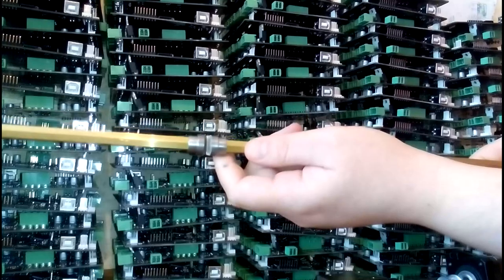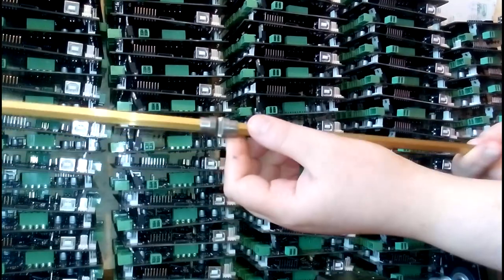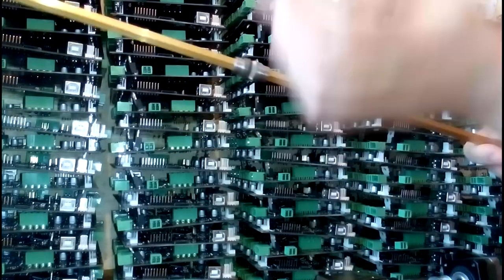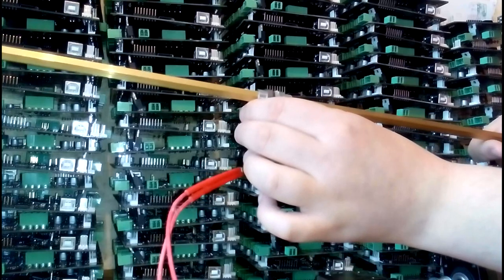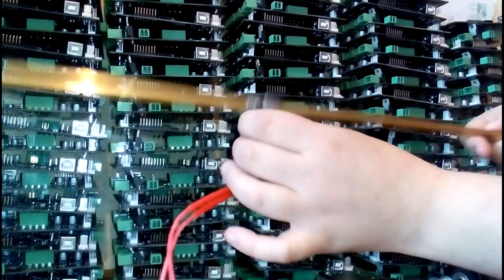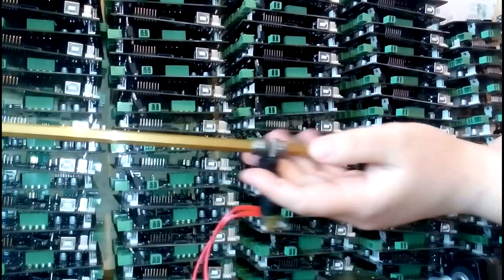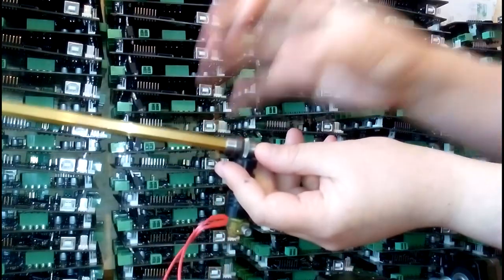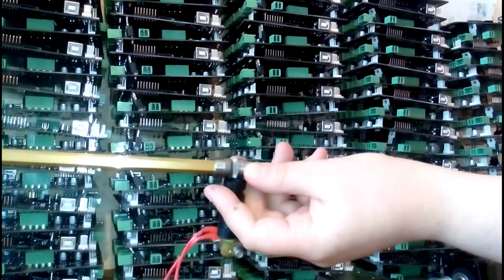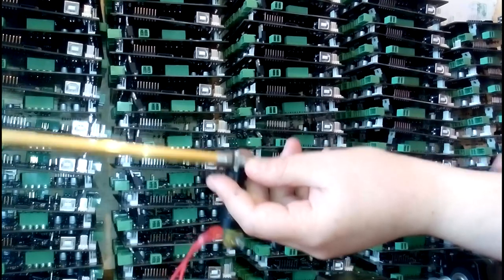What's great about this is — it's a bit more complex, you have to have more stepper motor drivers — but you can have multiple extruders, like three or four, whatever, and you have very, very little weight because all the stepper motors are outside, they don't move, they are fixed.